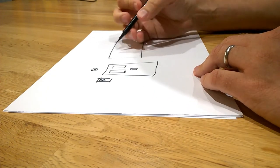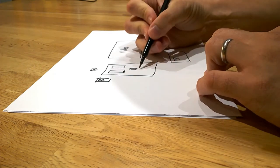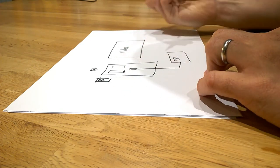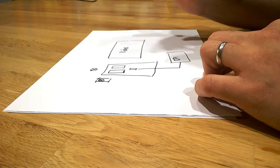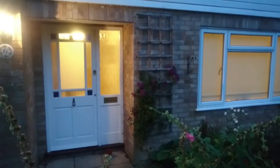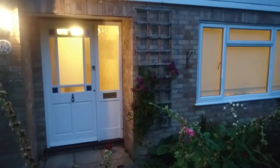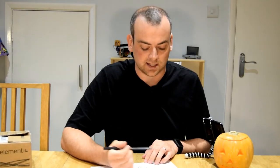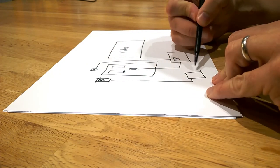The thoughts are we're going to get something to control it all, and I've got a Raspberry Pi for that. We're going to add some capacitive sensing to the Raspberry Pi using GPIO, building a low-level circuit rather than using one of the pre-built capacitive sensing circuit boards or hats. The internal lighting we're going to add to GPIO on relays, so these can be switched off and killed dead. The outside light is actually a smart home appliance, and I can control that by sending UDP commands from a script via network.